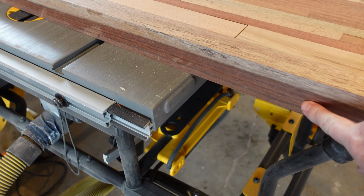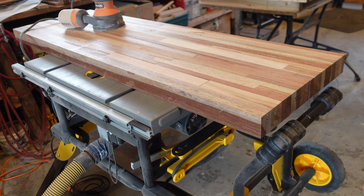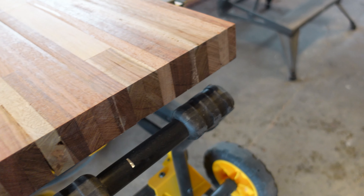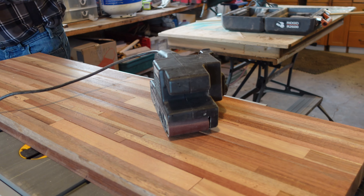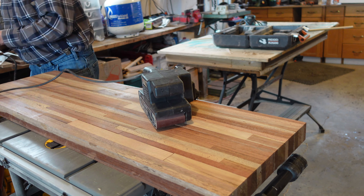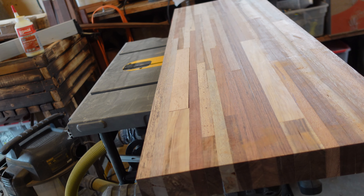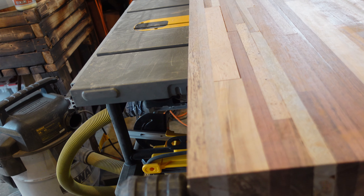I like that this end, the side piece, has two different pieces of wood, but that's going to get covered anyway by the picture frame. You can see all the nice different grains on the end here. We're going to use the belt sander to get this ridge off first, and then fine-tune it with the palm sander. Then we'll plane for the picture frame, and do the palm sander afterwards in case there are any gaps around the perimeter where the picture frame is going to go.